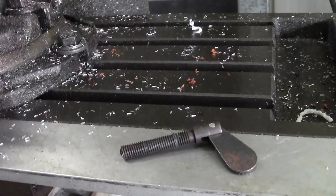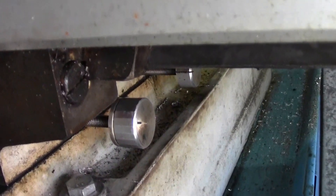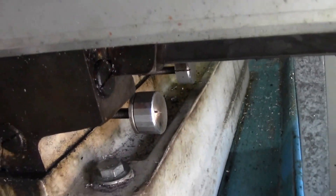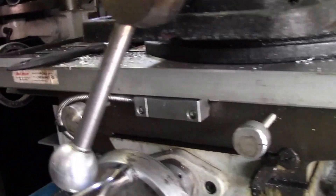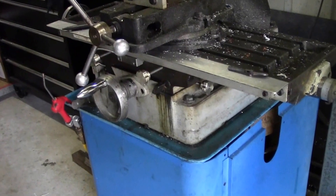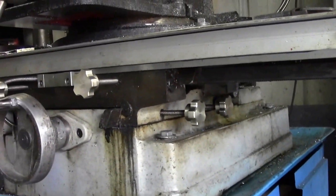These are the original locks for the gibs on this machine. They're a real pain because they used to interfere with this bolt — I'd be winding it across and wondering why I couldn't go any further. These leaves used to dangle down. Ages ago I tried some old stereo knobs from a box of junk and they served well for years, but I decided to replace them with some proper knobs. You can see the general idea of what I'm trying to achieve.